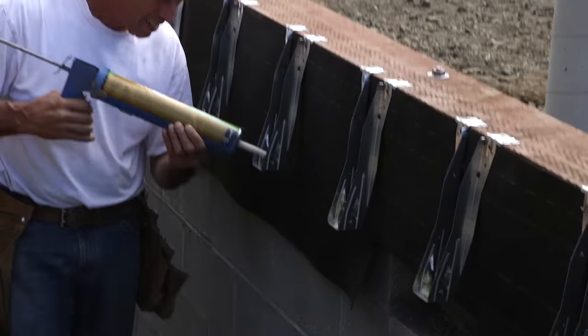So there's a couple of things that are important when you're deciding how rigid you want that floor diaphragm to be. The first one is how long is the span? What is the distance between supporting points that your joists have to stretch? How far are they reaching? That's the first thing. We are probably 15%, maybe 20% underneath max allowable span.